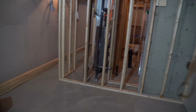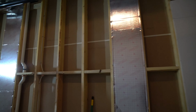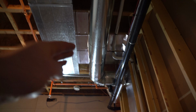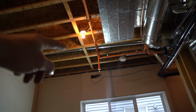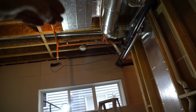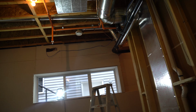Yeah. Today is the final day of framing. Mitch is on his way. We're gonna prepare everything. What I just ended up doing is moving that gas line over so we can fit our drop in here to cover this pipe. So it's gonna come across and then up right there. And then we're gonna be going from here to the wall. So as you can see, we have to go sprinkler height there, which is where our red line is. And then after we do that, we come over to this, then we have to drop it and bring it over here. Lots and lots of fun.